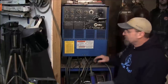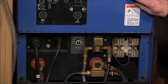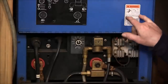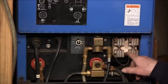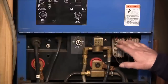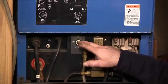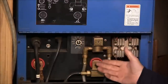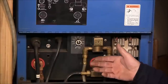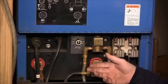Let's zoom in and look underneath the cover. Over here is the set of contactors — they only need to be adjusted if they're out. These are the high-frequency contactors with basically an 8-thousandths gap. This is your controlling factor for your high frequency. The reason I'm showing you in here is because we're going to be welding on high-frequency AC, and you need to pay attention to all the adjustments.